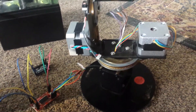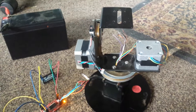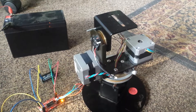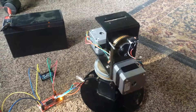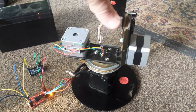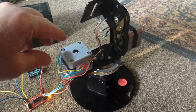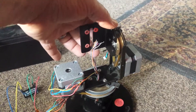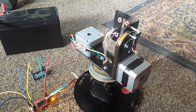a Pro Mini with an Accel stepper program in it that the SatNogs group uses. This will be based on the SatNogs design and firmware. Just for a demo I have the bounce test in here cranked up a little bit, but just to show that it does work. The azimuth has no end stop — it can go around and around forever. This has a little micro switch up here for hitting the end stop.